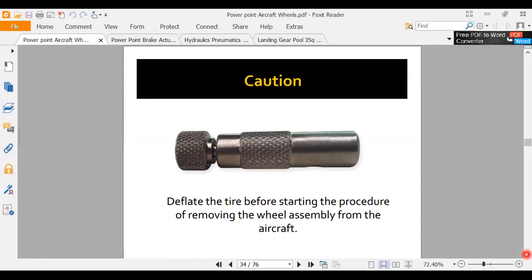Yeah. So what you do is a lot of times airlines will ship those things. Sometimes they'll have air pressure in them. Sometimes they'll have minimal. The safest thing is if they have maybe 100 PSI in them, and then you put it on the wheel and secure it on there with the axle nut. And once you've got the tire mounted on the wheel, it's safe to inflate it. Now, the wheel and brake shop has a tire cage, and they will inflate it inside a tire cage. If something were to fail, it's inside a cage and it won't kill you.